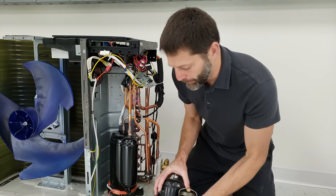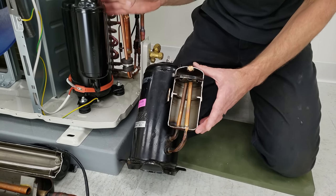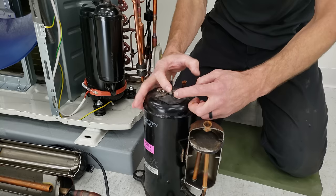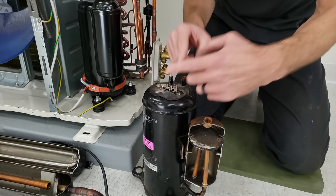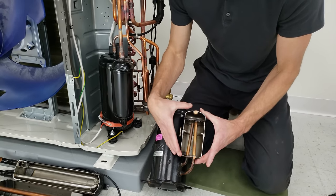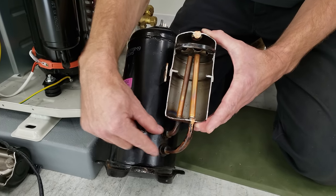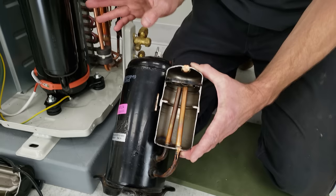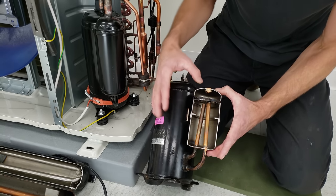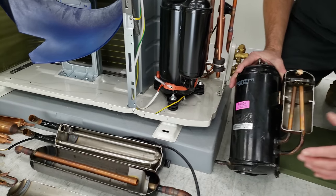On this compressor on the side, it's wound as a three-phase motor, so anytime you're checking the resistance value between any one of these pairs, the resistance value should be the same. On the side, you always have an accumulator tank, and you could have a single pipe coming in or a two-pipe depending on the size of the unit. This particular type of accumulator is going to have several different functions, and here we have some larger accumulator tanks I'll discuss in a second.